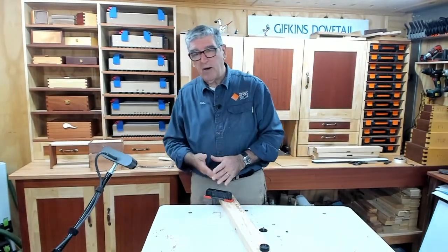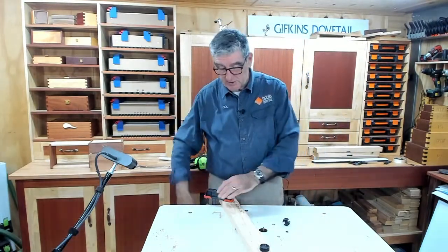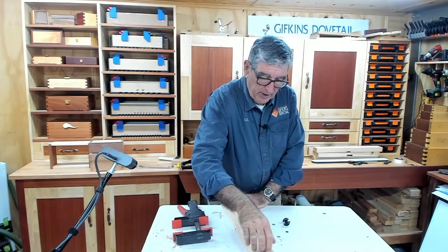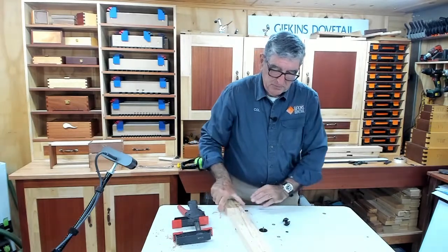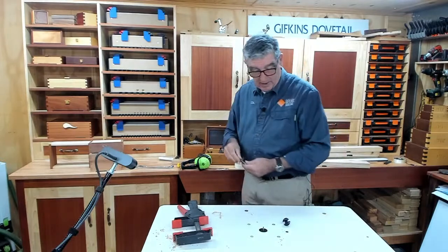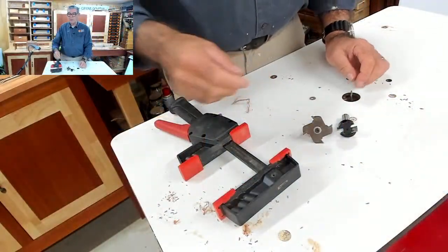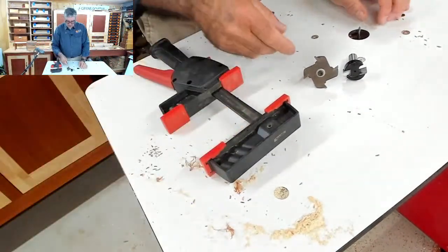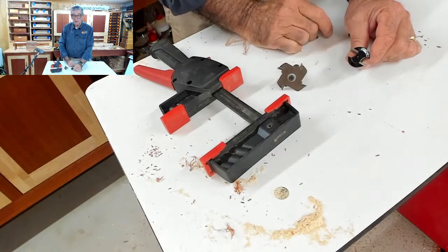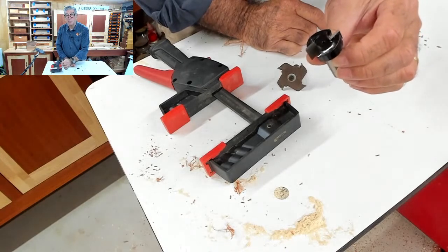Now the next task, there are a large number of different things that I use this one for. And I'll use that in conjunction with the tenon cutter sometimes, or with the rebate cutter sometimes. So we'll go ahead and do that. I think the two that are left to use are the tenon cutter and the slot cutter. Now, the tenon cutter has the same shape as the rebate cutter, as the panel raising bit, except it's got sharp corners on the top. If you can see that, get that closer. You can see it's got nice sharp corners on the top.